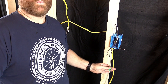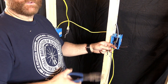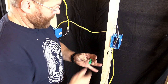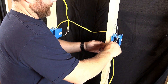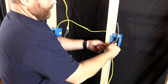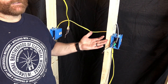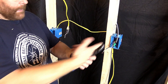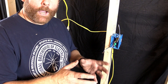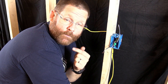This wall has been used plenty of times so my main wire is getting a little short, but I'm going to go ahead and do it anyway. I've watched a few videos of people doing this recently — not that they're doing it wrong, but there are a lot of issues. First of all, you always want six inches of wire coming out of your box. If you don't know what six inches is, take a mark on your pliers or your screwdriver. You have to make sure you know which wire is downstream and which is the home run.